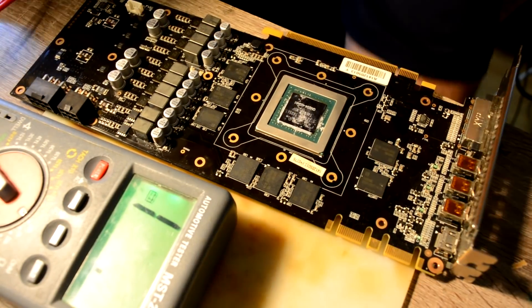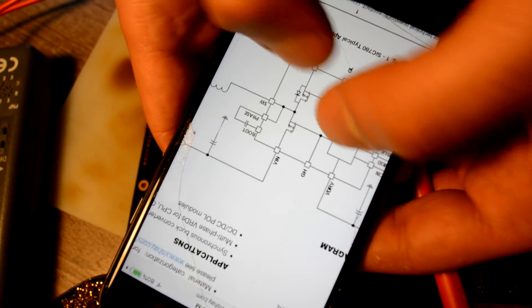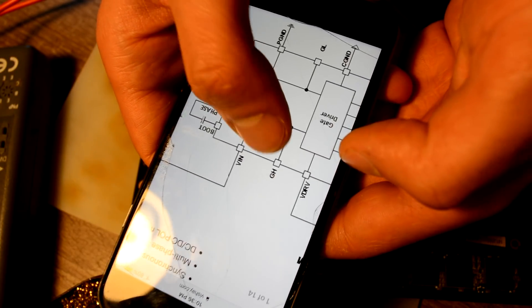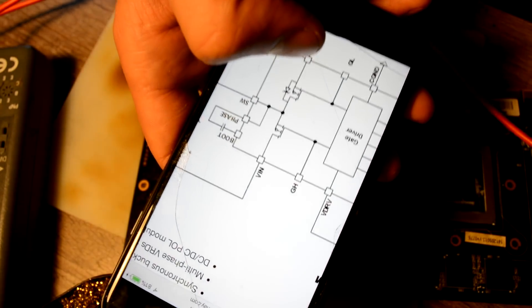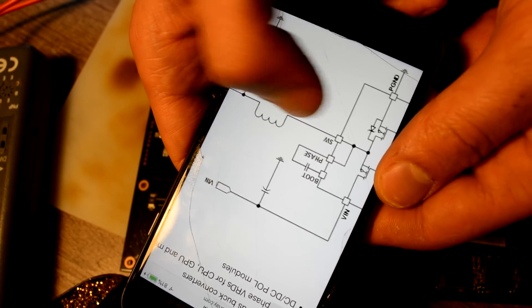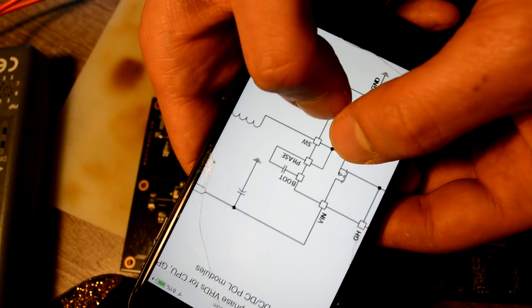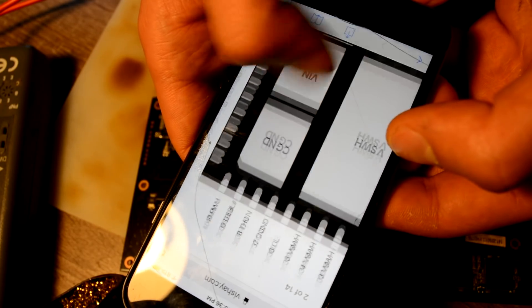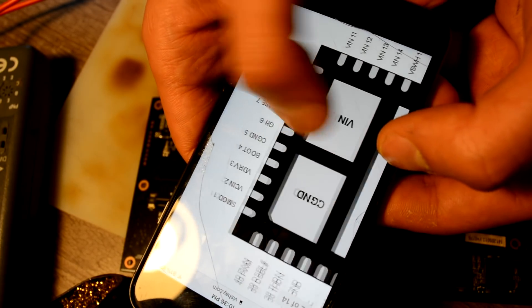We're gonna go through the keys. How I said, it's a driver and a MOSFET all in one chip. You're probably asking how we can check it - it's simple, same as a regular MOSFET, but we just have to find those pins. We need gate high - first we're gonna check top shoulders because most of the problems are because of them. They go out more often than lower shoulders. So we need gate high and we need a switch on those two pins.